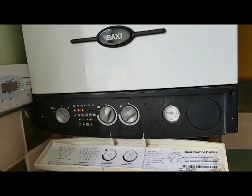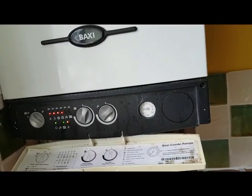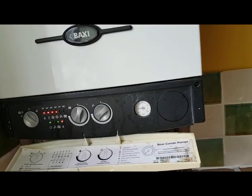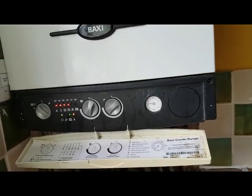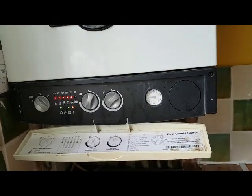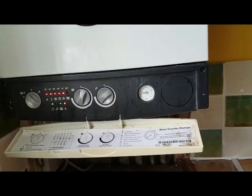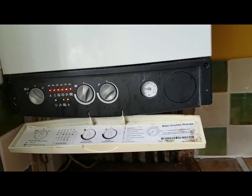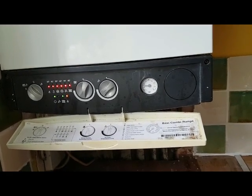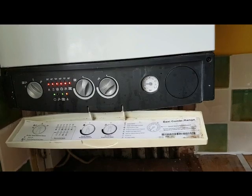What else can you tell from your senses? The boiler has lit up and the temperature is going up. So that's using the eyes — what about your ears? It's kettling. This boiler's kettling, it's making a groaning noise. It's getting too hot. When you hear that noise it means overheating, so get used to that noise. When it does that moaning and groaning, it's getting too hot. Anyway, the pressure is too low.